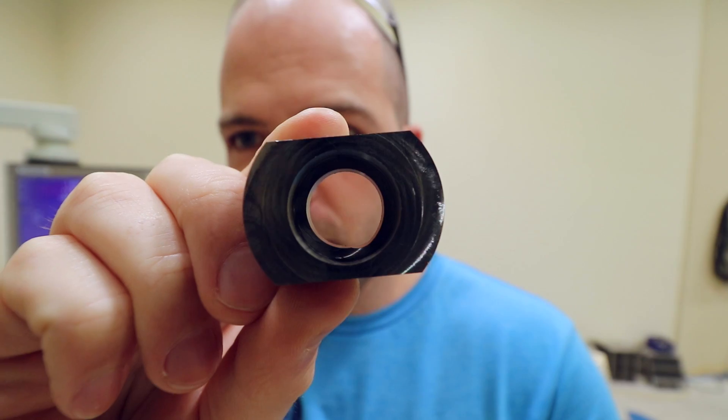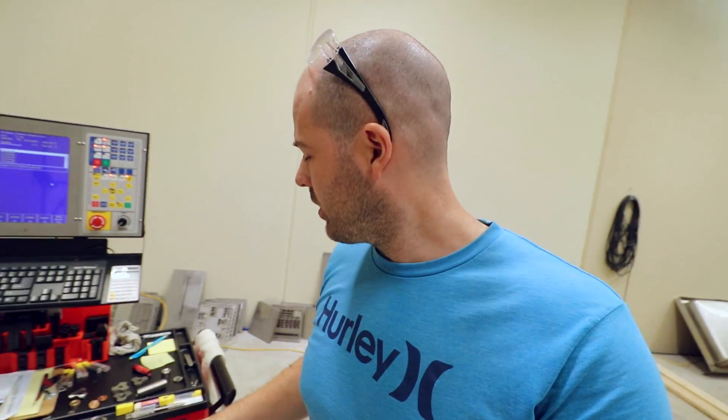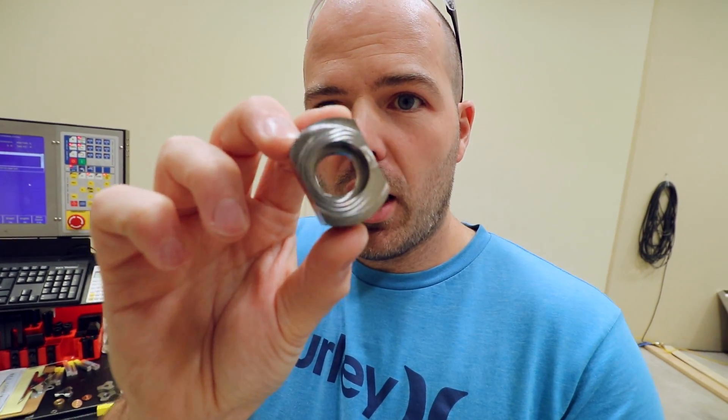The bearing was just slightly too big for this when I left it yesterday — I pushed it in and it just wouldn't go. So I got set up and started machining out the middle. But the hole is now way, way too big for this little half inch, 12.7mm bearing. I think what happened is the software reset the tool diameters. I had put in an 8mm tool diameter so it knows the offset and width of the tool, but today I went in and all the diameters were at zero again. I didn't know that before I ran the program. This is unfortunately a bit of a write-off now.